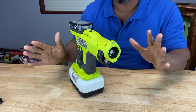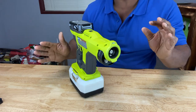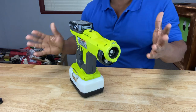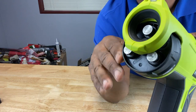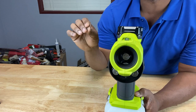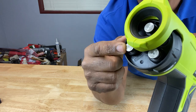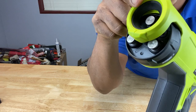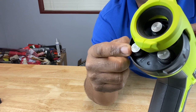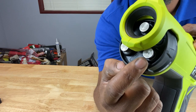Let's talk about microns. Simply put, microns refer to the size of very, very small particles. In the metric system, a micron is one millionth of a meter — very, very small — so we're talking about invisible particles like airborne particles, aerosols, droplets of liquid, and very small particles of solid matter as well. On the sprayer, this portion is called the mode selector — this is how you select the different micron size settings. The smaller the particle, the smaller the micron number. This setting is 50 microns, which is smaller than 75 microns, which is smaller than 100 microns. So 50 microns is the smallest particle size this sprayer can emit, 75 microns is one and a half times bigger, and 100 microns is twice as big as the 50 microns.